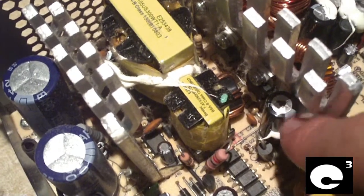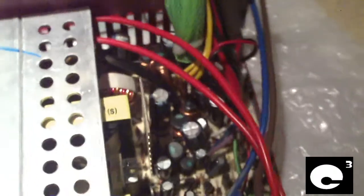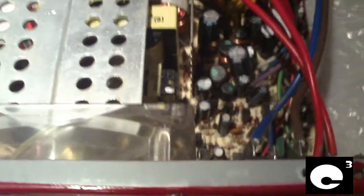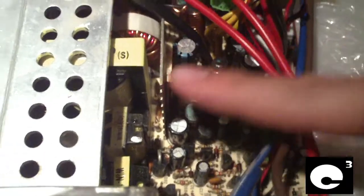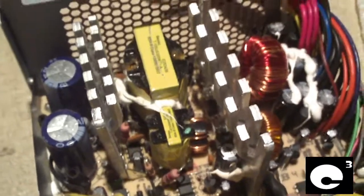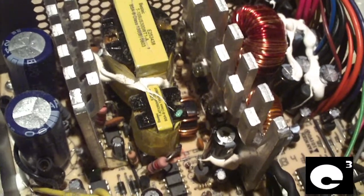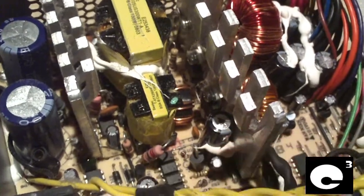Let's replace these two capacitors and it should start working just fine. I'm going to be recapping this one pretty soon. This other unit here is a Dynapower USA ADW-500, which is actually a Wintech manufactured unit. I replaced one capacitor in it a while back, but there's one back here that's bulging and another one here that's bulging, so those have to be replaced. With the Bestec, I recommend if you have the time and you're good at soldering, just recap the whole thing — replace all the capacitors with a good quality brand. Then you should be set.